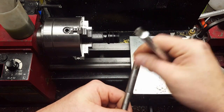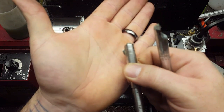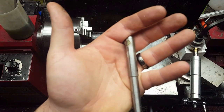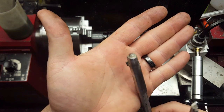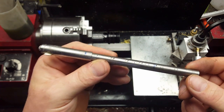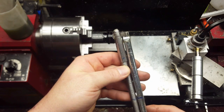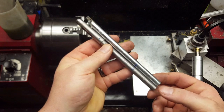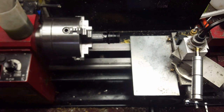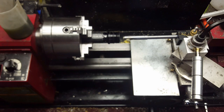I actually found my second boring bar — much easier. It seems to still have a honed edge. I've used it on some plastic ring making lately. But this is just a piece of that leaded alloy. I made this one before I got this carbide one, and it ends up they're almost the same exact length overall, which was interesting. This one is brand new, never used, and I figured I'd just take it out and try it. I'll put that right there. Set that to a positive rake — I had an Allen key out.